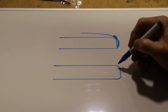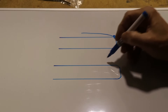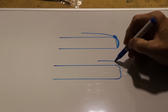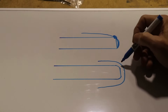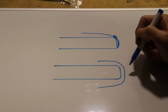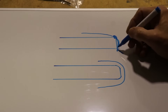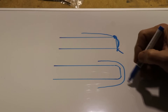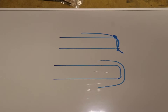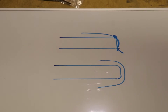But if you take this sheet and round off the corners — break that 90-degree edge — the paint will have more of a tendency to flow around it, which is much stronger and can help prevent chips. Plus, you just don't have that sharp 90-degree corner that can scratch your skin. A nice round corner just feels much better, looks better, and helps prevent chips on the paint.